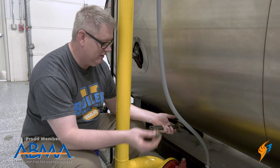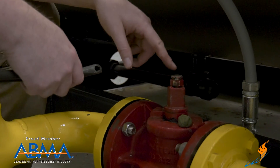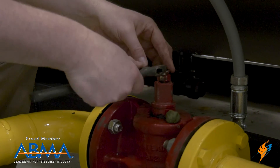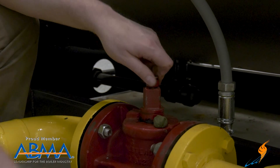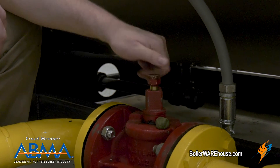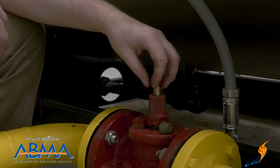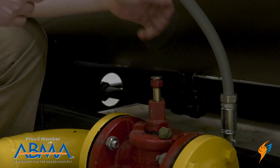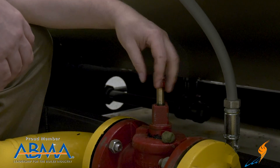So how do I get this in there is the question. Let's take a look at that. The same grease fitting that we would attach the grease pump to is threaded, and we can remove that fitting to expose the grease cavity. You may notice it's got quite a bit of thread travel on here. The point of that thread travel is not just to secure it in there, but it's actually going to be the force that compacts the grease down into the valve.